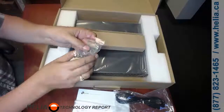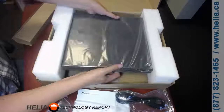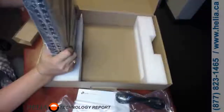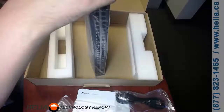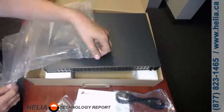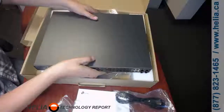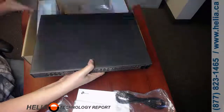Also included are feet and rack mounting brackets. To give you an idea of the power capacity, we recommend the Yealink T27P desk phone, which draws a maximum of 7 watts on PoE. Each port here can provide up to 30 watts, so it's really good at powering phones, cameras, or access points — all of the above. Whenever you're looking at an installation with a lot of PoE devices, this is what you want.